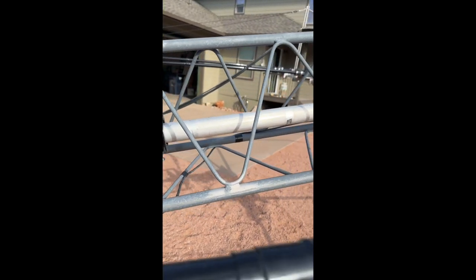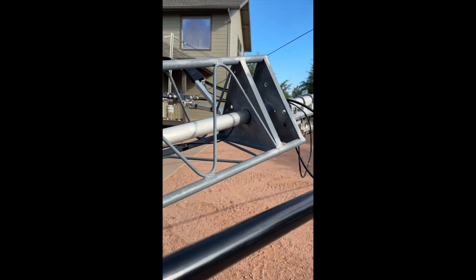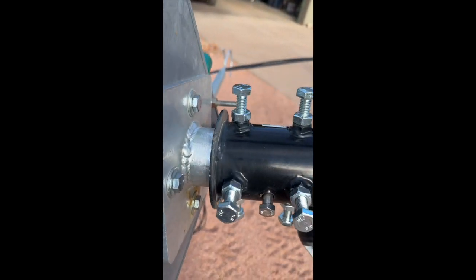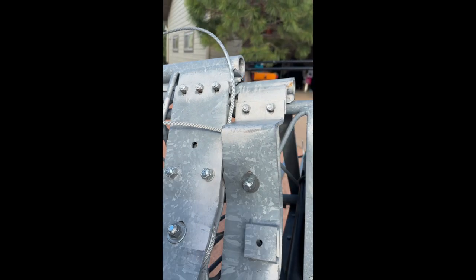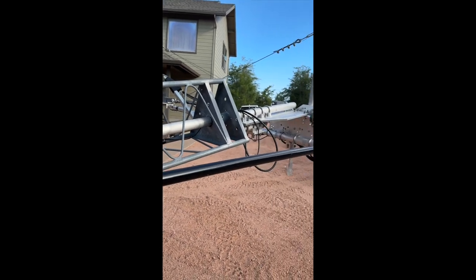It leveled it off enough that it turns freely. It's a good enough rotor that even if it binds it'll just force its way through. It sticks out a little bit, so there's a post here underneath the mount — it's permanently attached with a U-bolt on the other side. The tower can't crank down below this post, which leaves a loop of wire up here since it's not cranking all the way down. That makes it worse because this thing is now 200 pounds sticking out further.